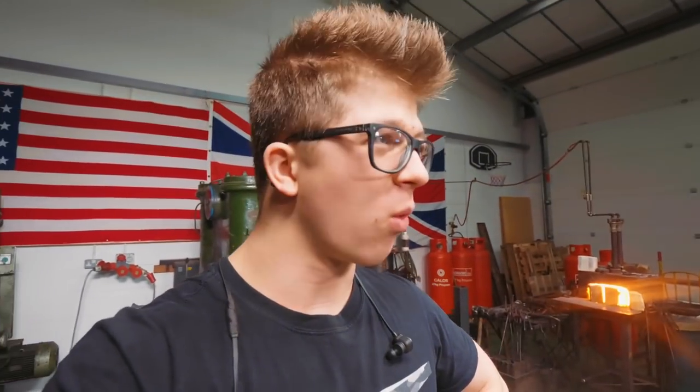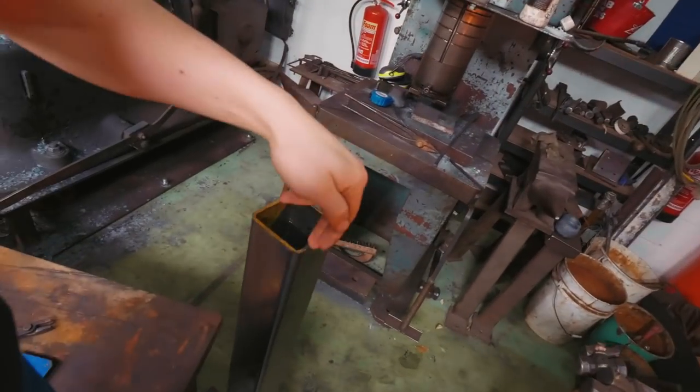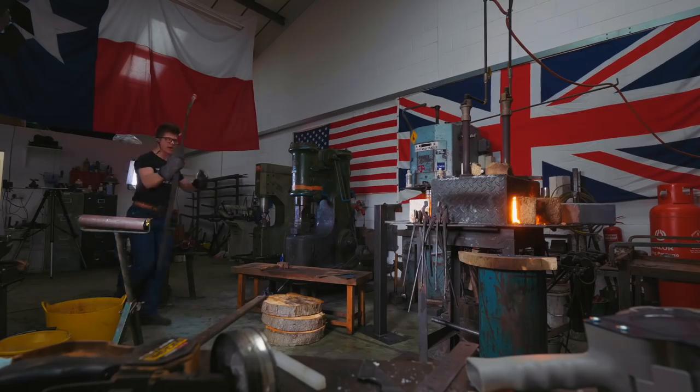I'm not really sure how well this is gonna work, but I think I'm just gonna go in for the heat treat now. The big problem yesterday is that when I pulled it out I used that pocket of time to try and straighten it, put it back in to finish cooling, then left it leaning against the edge. I wonder if as it was cooling, the weight of the blade at an angle in the quench tube caused it to bend. This time I'm gonna hold it straight down, hold it halfway through the cooling, pull it out, check it, and hold it straight for the finish cool. Hopefully we'll get a straight Scottish claymore — let's make it happen.